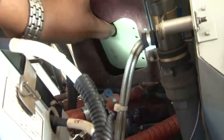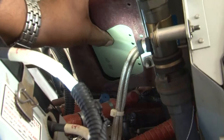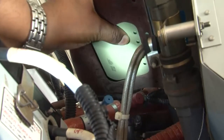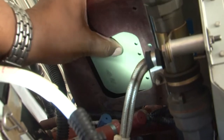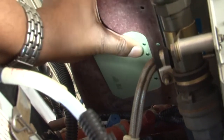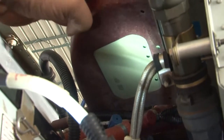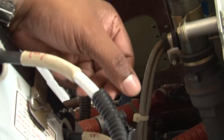See, you can see this. This is your alternate air induction door. So in our 50 hours inspection, we are going to do a visual check. We are going to operate this door also and we will see that this is properly opening and closing and it is firmly in place. So this is also an inspection to be carried out at 50 hours.